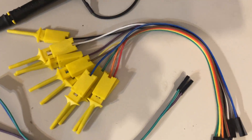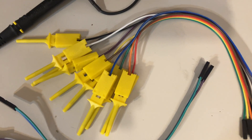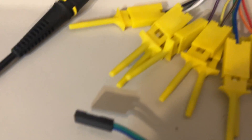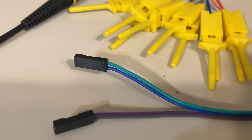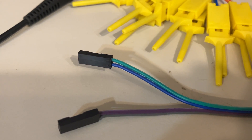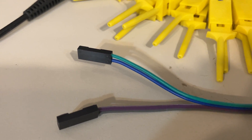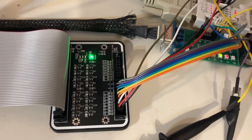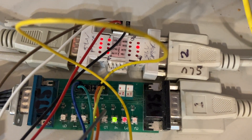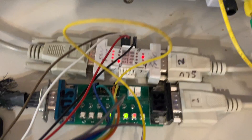You have 16 inputs — the left part is the signal and the right part is the ground. It came with nice hookup wires, but I recommend if you design a board, just put two headers and use those pairs of cable with a connector at the end. The idea is to have a ground and a signal, and you twist the entire pair from the logic analyzer up to your design that you want to investigate.